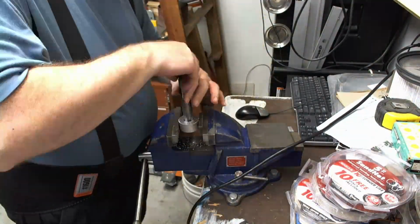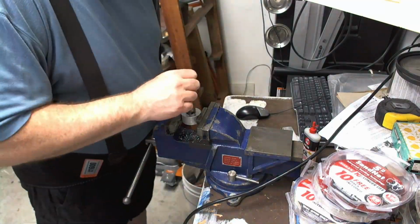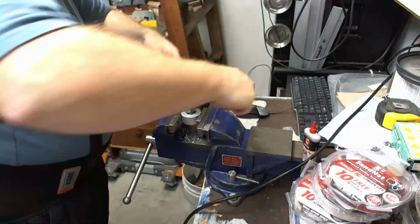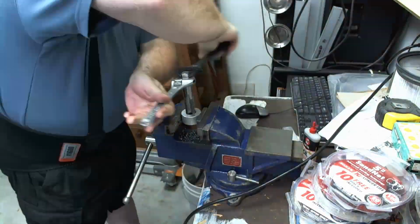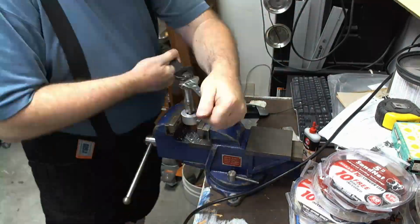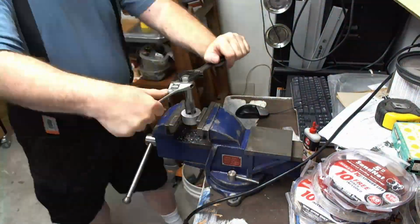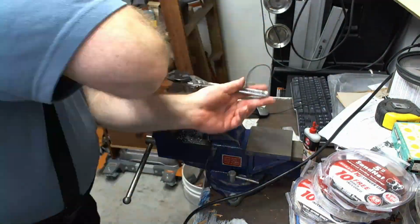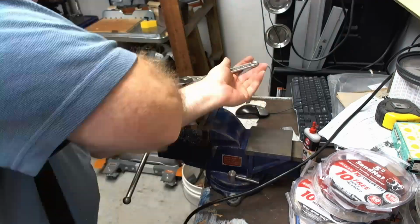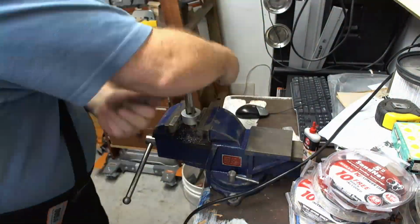So it's like, okay, what the heck? So I worked and retightened that, put oil on it. That might have been part of the problem, but I also just went in tiny little bits. Turn, go back, turn, go back, turn, go back. Yeah, this is a 1-inch tap, and that was a 7/8 inch hole, so it takes a lot of work. But the oil seemed to have helped in just going really tiny increments. And I also do think it was because it was harder on the one side than the other, because it eased up after it got down towards the other side for the cutting.